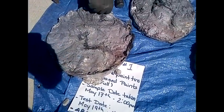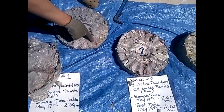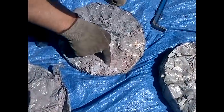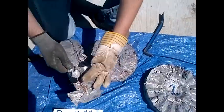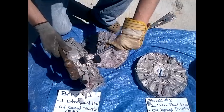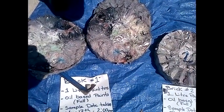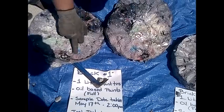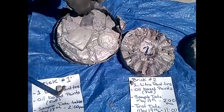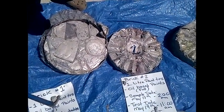All of these bricks were made without solvent flush internally and without solvent flush externally. As you can see, it is a small film but a very low content per brick. I'm going to get another layer apart so we can see — again, the very same thing: an extremely low level of paint. The dry residue in the bottom of the cans we can't do much about. The bricks are pretty solid, the outside is nice and clean, and I believe this would be a very saleable product to the scrap dealers.